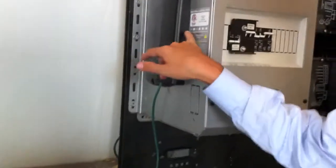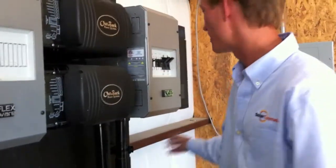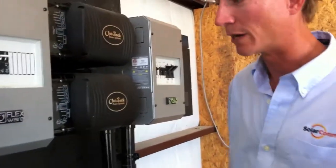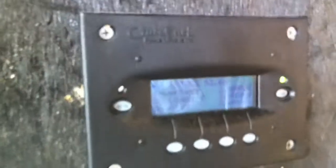And then this is your Mate here — this is the brain, basically, so to speak. When your generator comes in, I need to get some more Cat5 wire for the charge controllers. You can plug your charge controllers into your hub here and control everything from the Mate. Right now you can just set up the inverters and look at stuff, but you can't control your charge controllers yet because I forgot the Cat5 sitting on my desk. But it'll all be plugged into the hub, and you can do everything from there. Your manual for the Mate — it would be a good idea to look at it so you know what it's telling you and how you can change things if you need to.